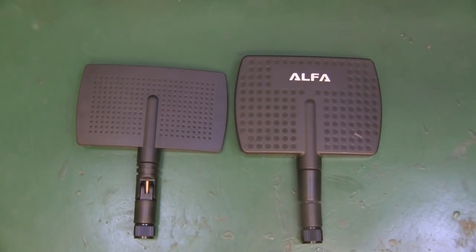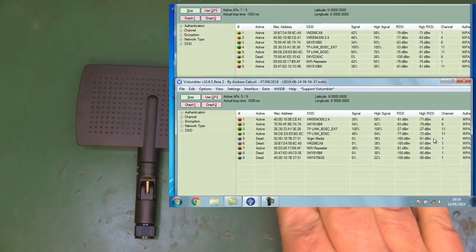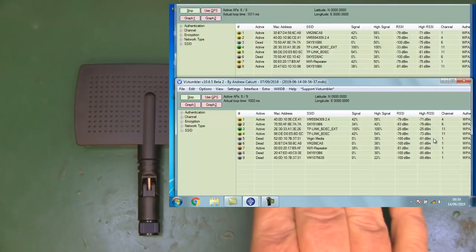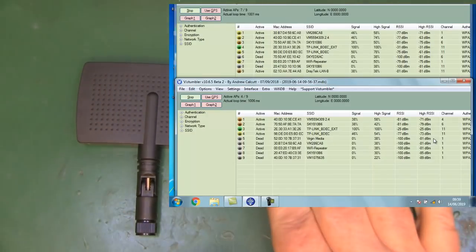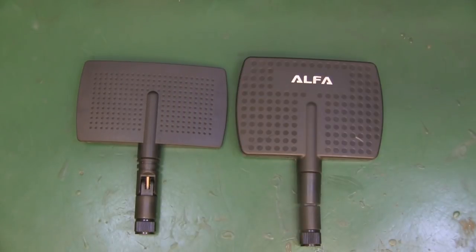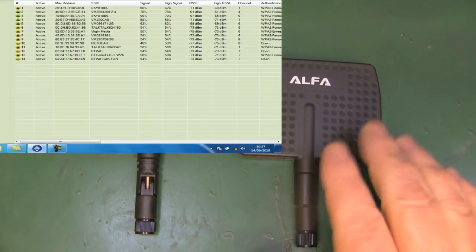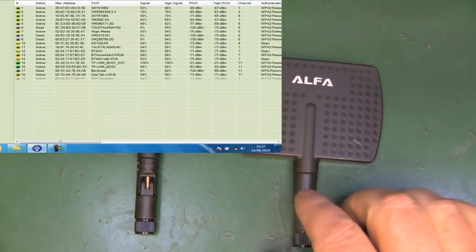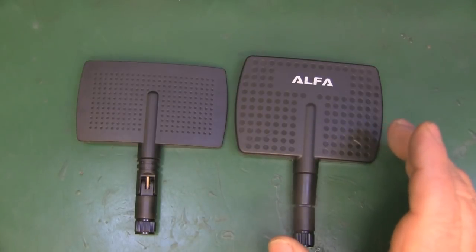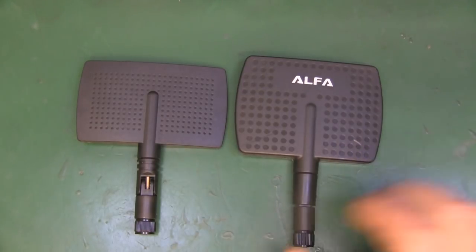Even the Alpha one is not going to break any world records. I've got a scan here — the Chinese one on top and the Alpha one at the bottom. The Chinese one claims to be 1 dBi over the Alpha at 8 dBi versus 7, and you can see it does perform a little bit better, so it probably is working at around 8 dBi. Both antennas won't break records, and a single bi-quad really does knock things out of the park. A bi-quad I built some time ago using a PCB as a reflector performs much better than either of these two, due to its wider beam width and slightly higher dB output, picking up a lot more access points.